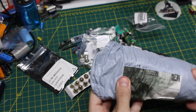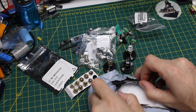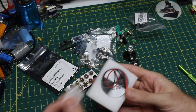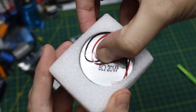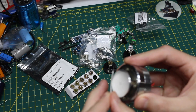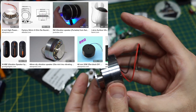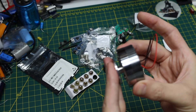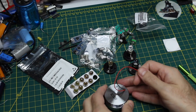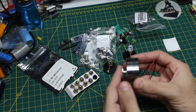Then there's this one — it's kind of heavy. This is something I ordered long ago. 8 ohms, 20 watts. I think this is a double-sided sticky mounting thing — this is a surface transducer. You put this plate in contact with a hard surface and it uses the surface as a speaker cone type effect, so you can use objects to transmit sound.